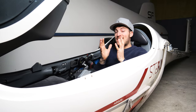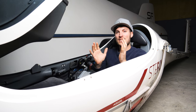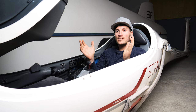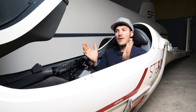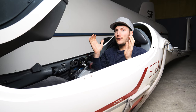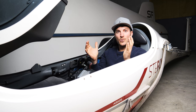The canopy flasher is really an amazing safety feature, but of course it does not help in all cases. It's still as important as before to look outside of the cockpit and outside of the instrument panel during flight. In blue thermals or similar bright conditions, the intensity of all canopy flashers on the market may not have enough brightness to really warn you. It only helps if you are flying below a cloud street, if it's a little bit darker, and so on. But even if there is one case when it helps, the money is invested well.